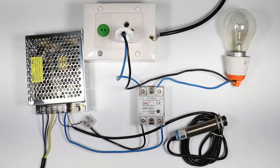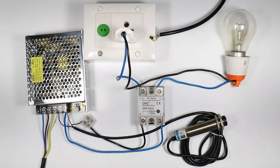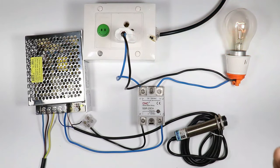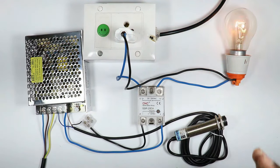The control wiring of the SSR through this sensor is now complete. If I place an object in front of the sensor, the lamp turns on, and on removing the object the lamp turns off. You can see how fast the switching is happening. Also notice that no sound is produced when operating the SSR, unlike a contactor which makes a knocking sound. I hope you liked the video — please like, share, comment, and subscribe.